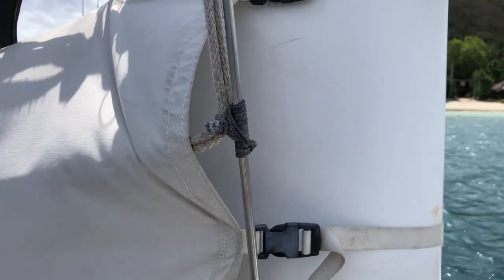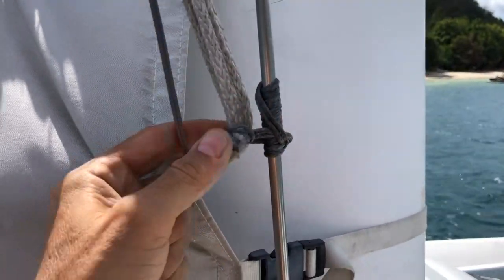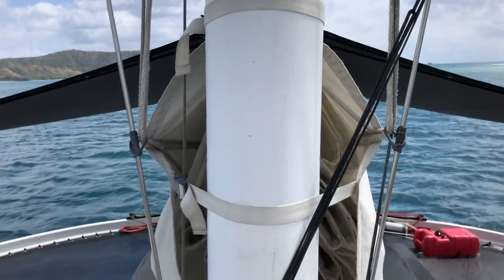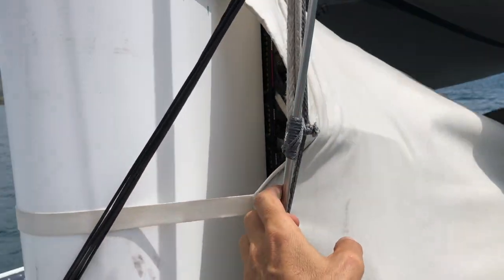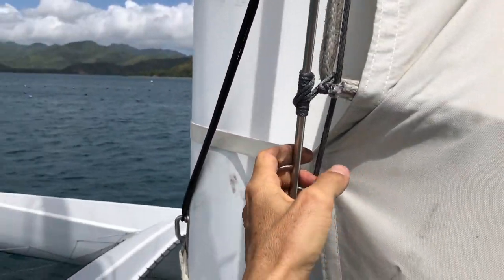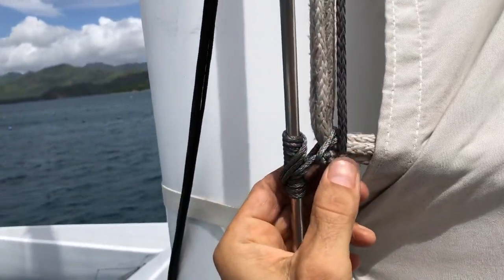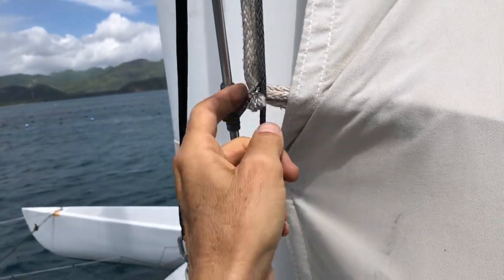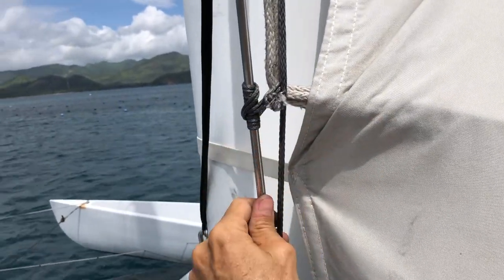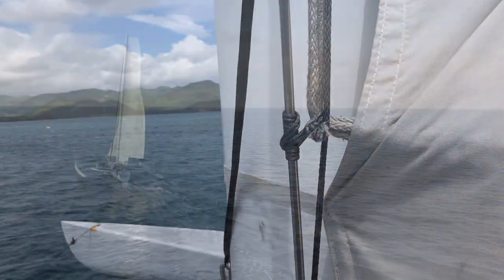You can make them yourself really easily and they're soft — you can attach them anywhere. Fantastic. So there you go, both of them secure — one here on the starboard side, one on the port side. Looking aft, it just secures itself with that little knot going through the loop. Super easy to get on and off — as soon as we release the load we'll just be able to pop the loop over the top of the knot and release the lazy jacks. Nice and easy.